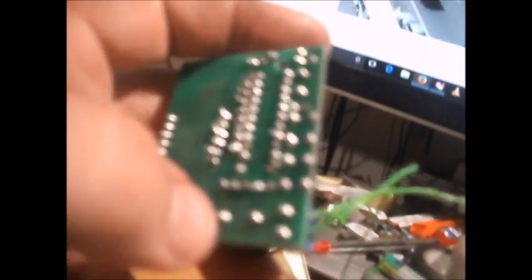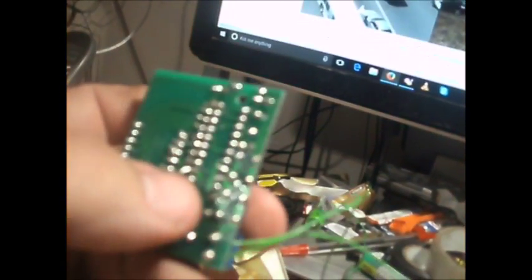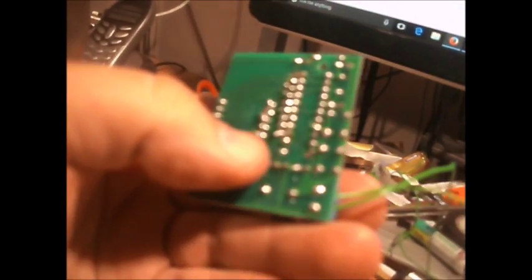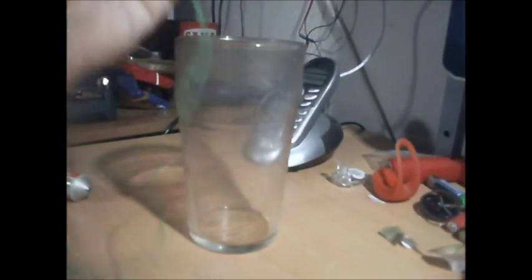Yeah, there's a few dodgy joints on here. The buzzer isn't working, but I've found one of the contacts off the IC that comes down through a resistor to the transistor to the buzzer is shorting out on the resistor. Row of resistors, I think that's what that black thing is, hiding in that gap, like a resistor bridge. It's shorting out to this first terminal. That could be why the buzzer's not working, so I'll sort that out tomorrow. It's not too important, because I don't want to use the alarm on it anyway, but rather than leave it and risk it doing some damage, I'll sort it out, and I'll find a 5-volt power supply for it. It would be nice to find a way of mounting it up on the wall.